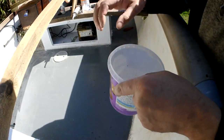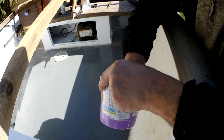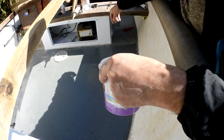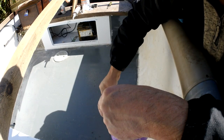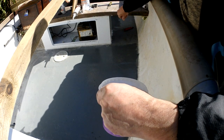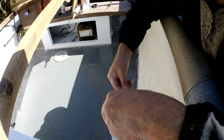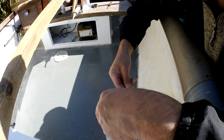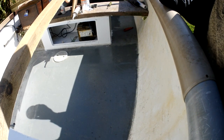The secret ingredient is a little bit of sand. Just literally going to flick a little bit on to stick to the gel coat — when we paint over it you'll have your non-slip surface. You don't need much. It's not a shiny surface obviously. You could put it in the mixture but you'd end up using a lot more. This way is fine because we are going to paint over it. The sand is really fine stuff so it literally just sinks into the little bit of gel we've got down here. We'll add a bit more in the paint when we paint.